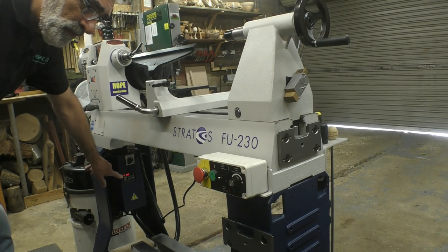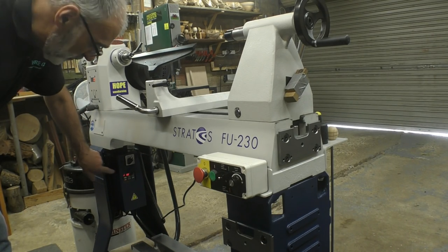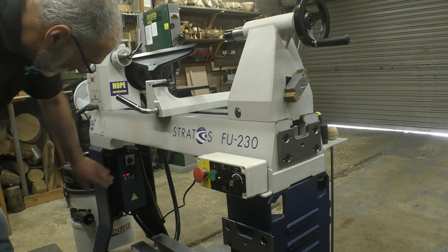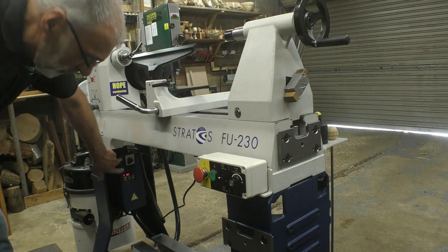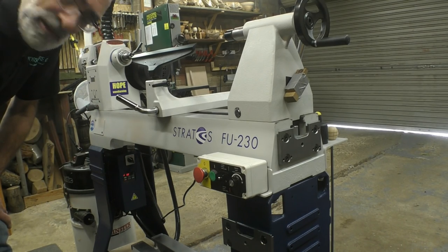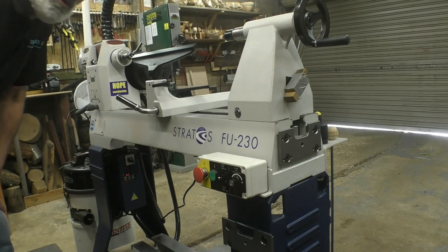You can see down here — this is the inverter. It does actually come separate. There are two mounting points on the lathe, one on the left leg and one on the right leg, and you simply screw it in with four screws. I've seen somebody post a picture on social media having it on the wall behind with the wiring done to accept that — that's fine, but I like it here and find it very handy. It has an on/off switch which takes the power completely away from the machine. Click it off and that kills the power to the lathe completely. On most lathes the inverter is underneath the bed without a switch, so this is an added safety feature.